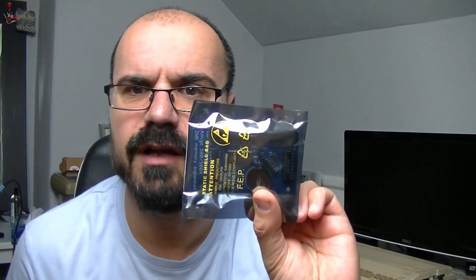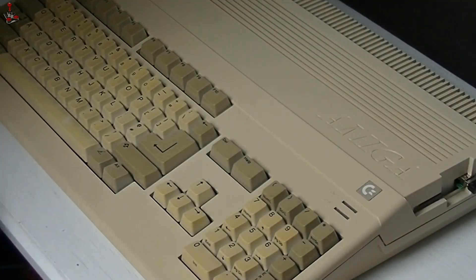It's basically an expansion card that goes into the A500, which will upgrade my chip RAM to 1MB and also give me potentially up to 1.5MB of slow RAM. This is achieved by a small modification to the motherboard, soldering to a jumper point, and using a Gary adapter to add more memory lines to the machine's architecture to allow it to see more memory. It's also got a coin battery holder and space for a real-time clock chip.